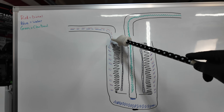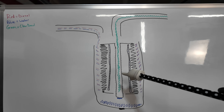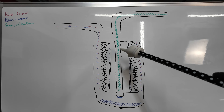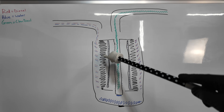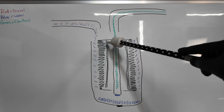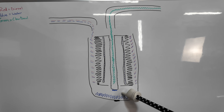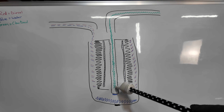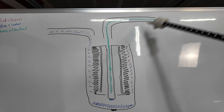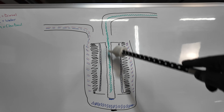Fuel and water come down into the side of the fuel filter housing and go around — obviously the whole fuel filter is 360 degrees — and it will go through the media right here and collect all the debris. There's additional media that actually collects and retains the water, dropping it down into the bowl. The sensor is located there. Once the fuel goes through, the clean fuel goes up through there and travels through another screen that water cannot get into.